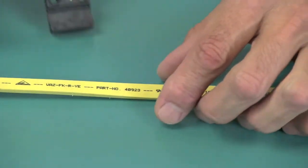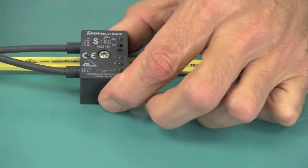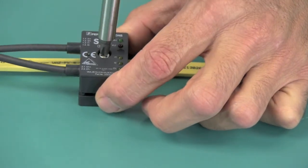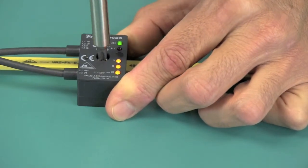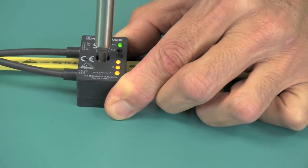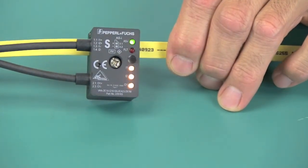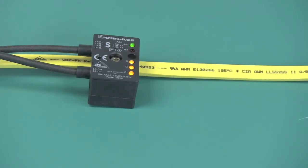After opening the housing top, the AS interface cable is inserted in the top tray. The bottom tray is there in case the installation uses AUX cable, which makes installation convenient. Note that the AUX cable is not needed and is not pierced — not inserting the AUX cable does not impact the IP rating of the module. After closing the central mounting screw, the module is up and running and ready to be used in your IP67 installation.